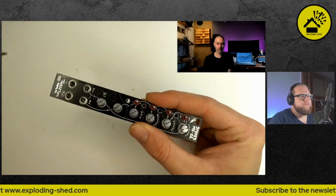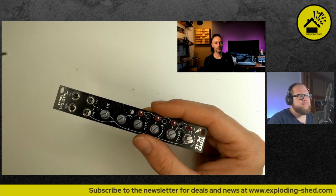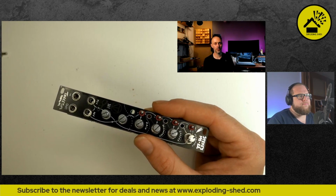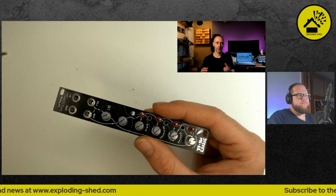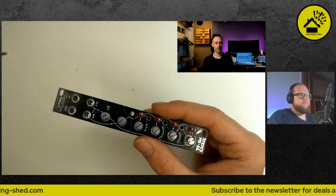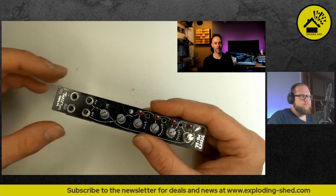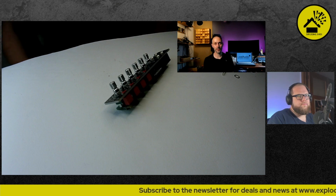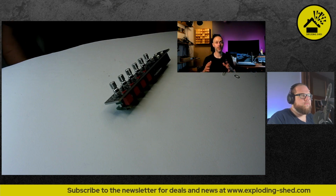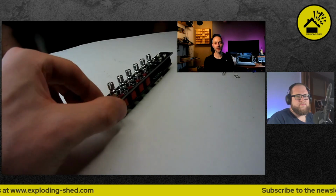Yeah, Andy managed it. We do this because that's a good trick in general. I mean, you can solder all these components individually, and just hold one component at a time, flip it over, solder it, and so on. But if they are not absolutely aligned, the more components you have on your PCB, the more difficult it is to get the panel on. If you have a module with 25 jacks or so, and they are not absolutely aligned, it will be impossible to attach the panel later. So that's the trick. You do it first.